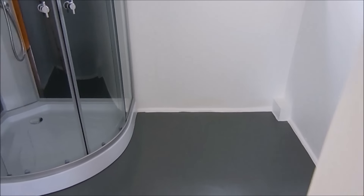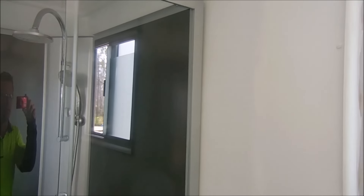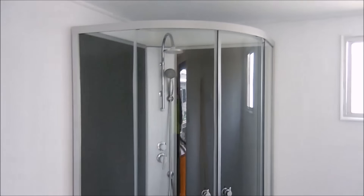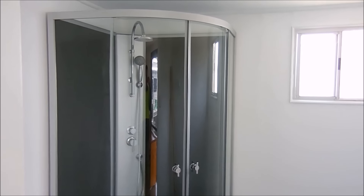With a few minor adjustments we'll be able to push it back into position. The shower unit is installed now with all the glass doors in. I've got the hot and cold and the drain plumbed through the floor, just taped off for the moment. I've got some timber to trim the edges where the shower unit goes into the corners just to hold it in place. It's self-standing and self-supporting, but I'll pin it with some removable trim so I can pull the unit out and fix any problems in the future if needed.